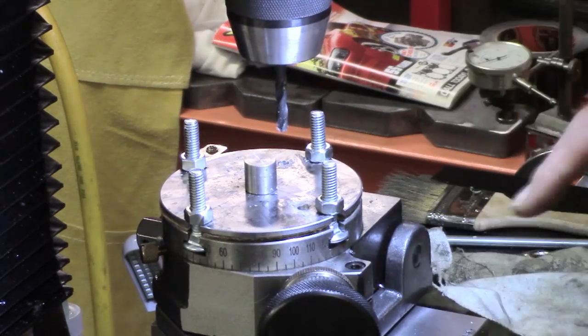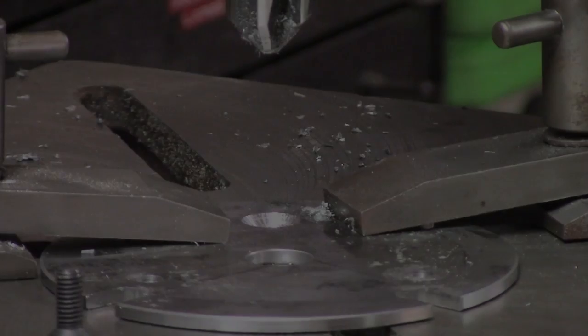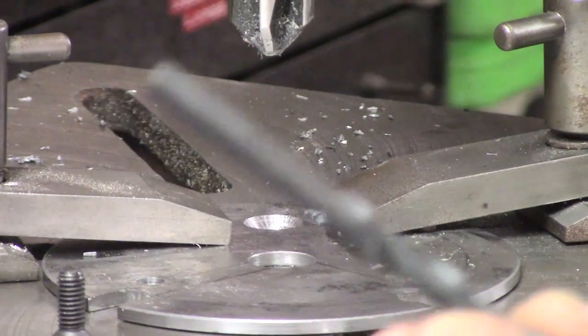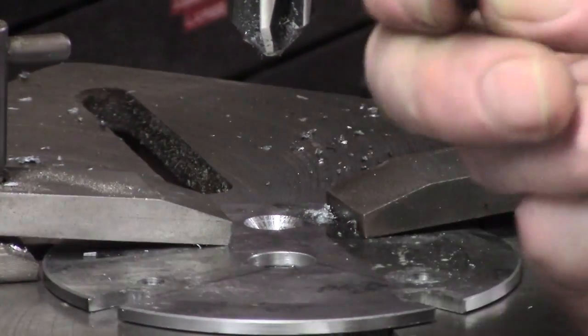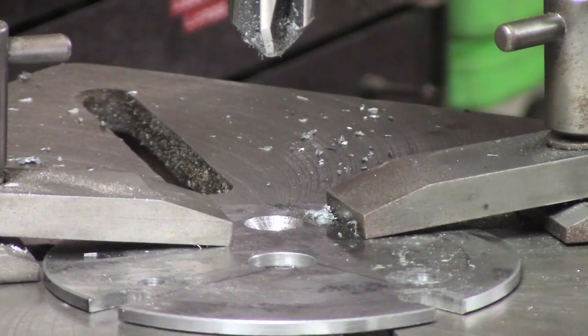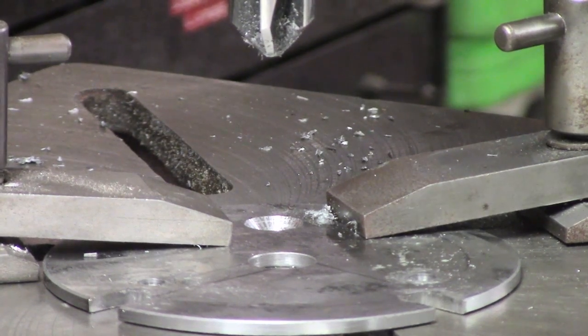So I'm going to finish off in the drill press. Right, on the drill press now — I use this 15/64 as my centering setup in the chuck, set up the table for a height whereby the countersink could work. These 6x1 countersunk cap screws — well, not a cap screw quite — they mic up at about 4.6 something. I'm just checking to see; about 4.65 or something. But anyway I've gone a bit deep — I want to check if that shows. Yes, you may just see we're just below and I need to try and do the same on the other two.